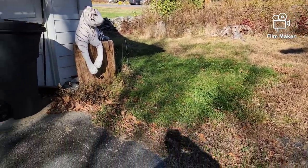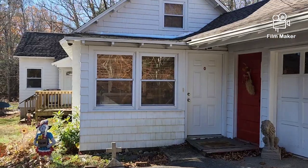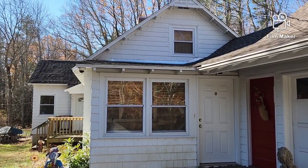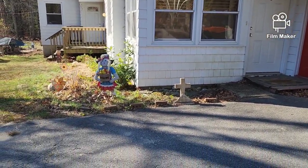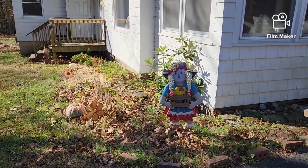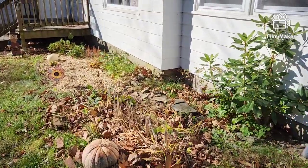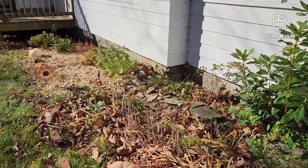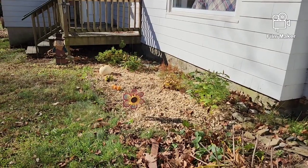Good morning everyone. I got some chores done — I was able to get up on the roof and remove the green moss that had grown there. I don't remember having that before, but last year was a really wet summer from about March to September. I was even getting mold and mildew inside the barn, which is unusual. I sprayed it with commercial vinegar, which kills both mold and mildew spores — unlike bleach, which only kills one.